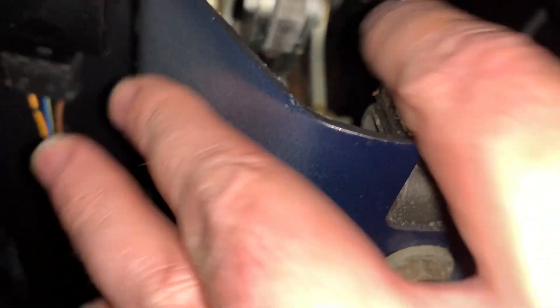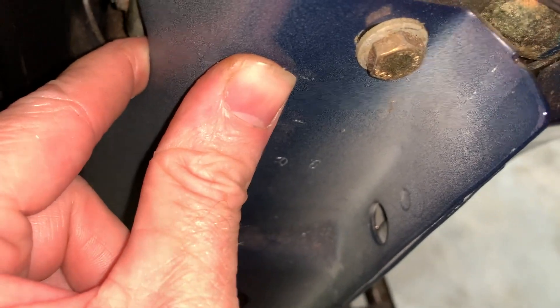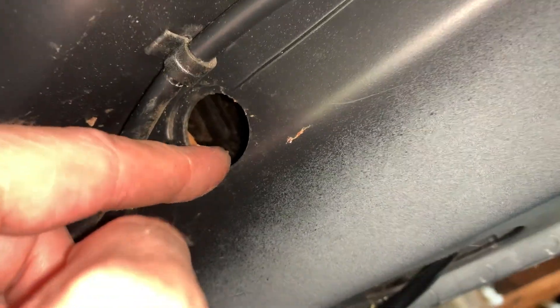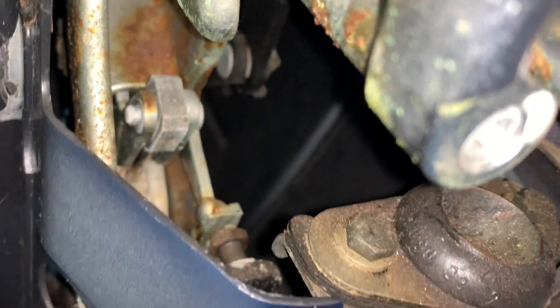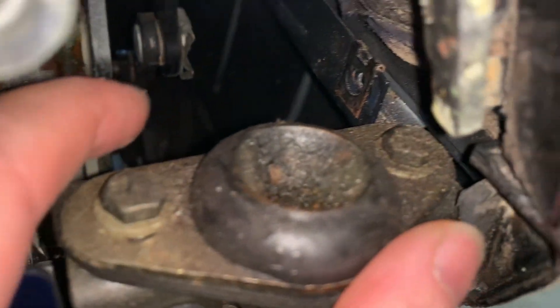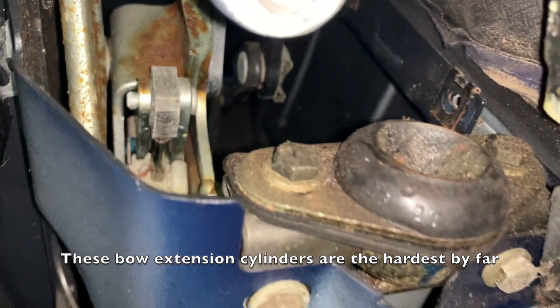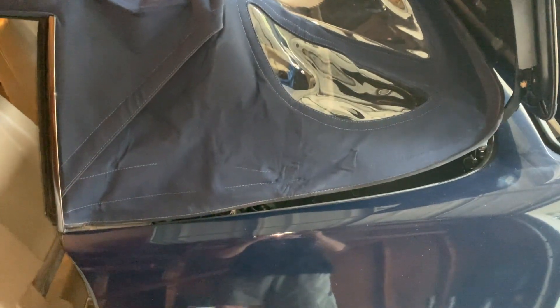To get the bow extension cylinder out: I took a pick, had my magnet next to it and pulled this way - it just launched right there. Got the top one out and I already got the bottom one out. The bottom one is usually right here - pull the pin out, tap it out, and it lands in there. Have your magnet down in there to catch it. You want the top down to get the bottom one out, and the top up to grab the top one. This is really dangerous because if you do it wrong you'll break the thingamajang.